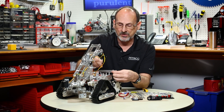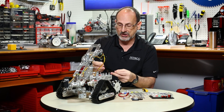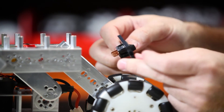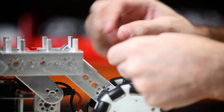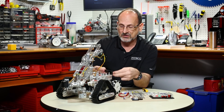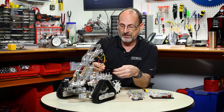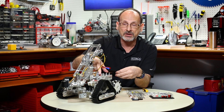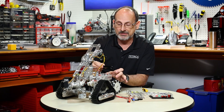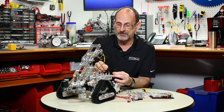Before I do that, I'm going to think about the other components I'll need as well. If I mount my Prism here, I have to relocate my switch. I could put it on the back with two-inch standoffs, but for ease of wiring and being able to use the switch, I'm going to mount it off the back of these two plates using an angle bracket. That'll get the switch out of the way and let me route and protect the wiring as well.